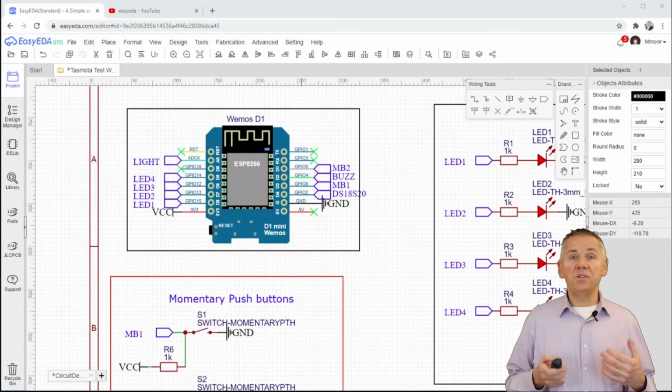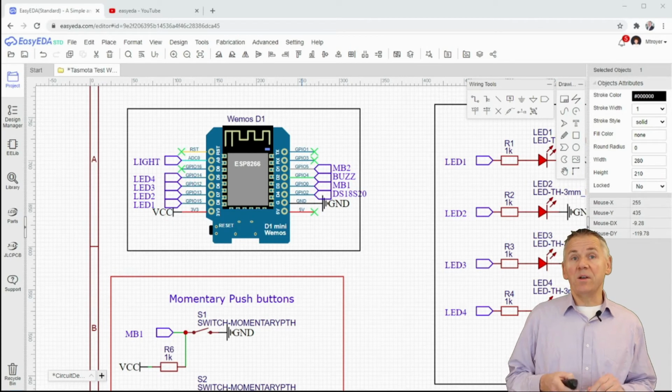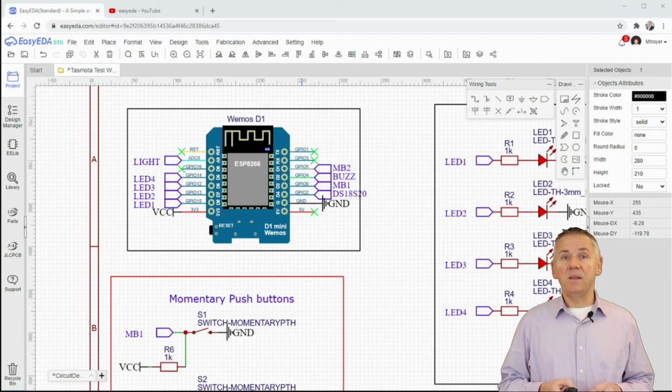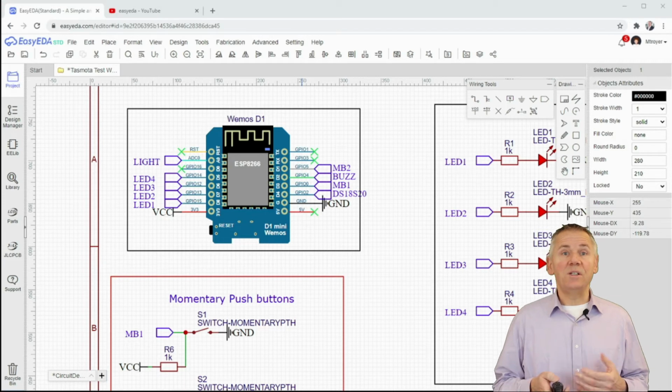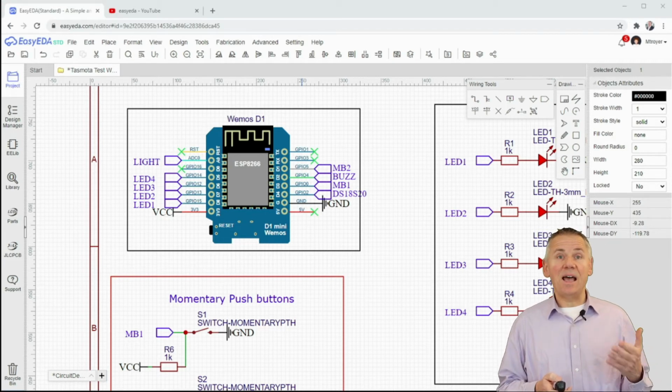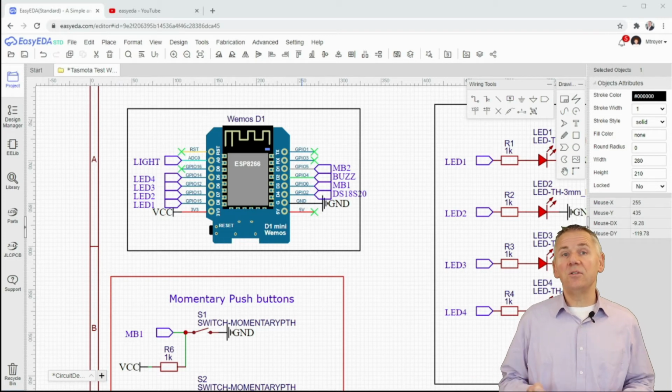The first and most important sub-design is the actual microprocessor board, the Wemos D1 Mini. As you can see, there are 2 pads of 8 pins on this board. Most of these pins have been connected to logical network ports or nets, which link to the other sub-designs. Network ports or nets allow for easier to read and modular designs in general.